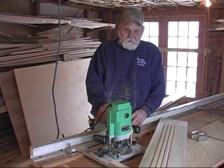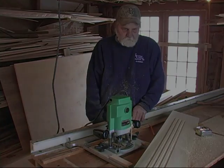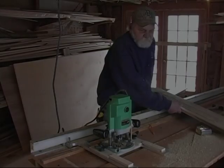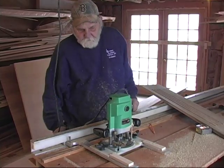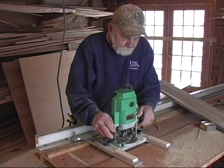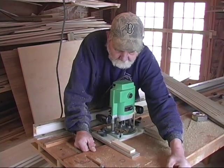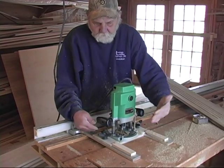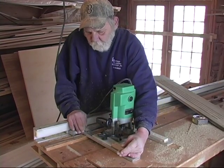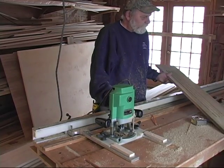Once this is set up you can run these things — one a minute. The adjustment: we've got a three-foot bar clamp on both ends. This slides — just move your clamp. You can keep going out the length of this; we could do a 12-inch fluted column. I've done some fluted columns at 16 feet.